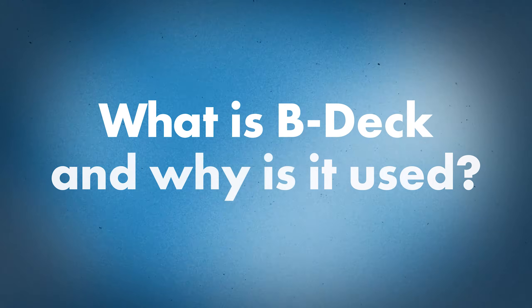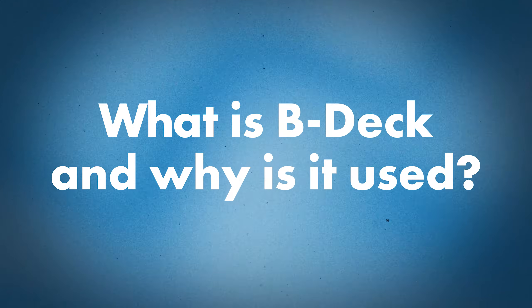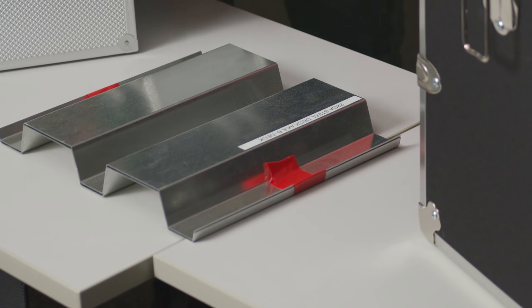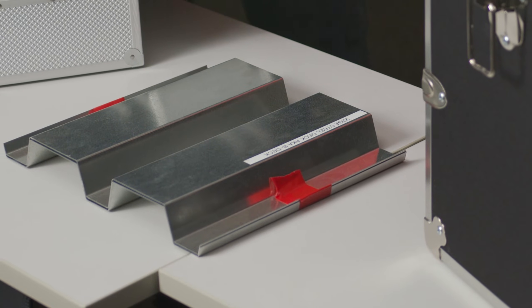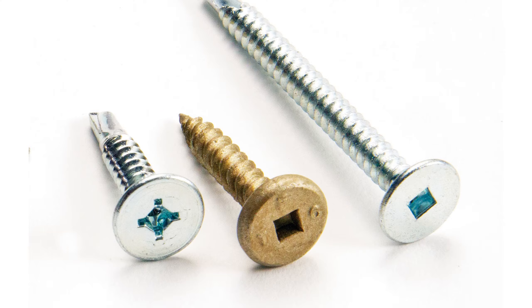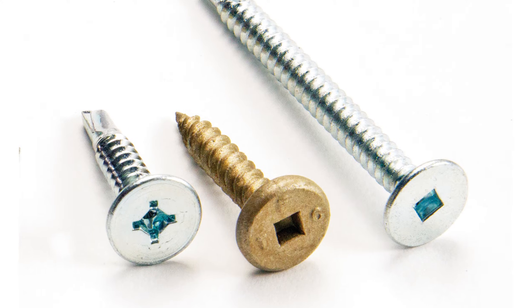So what about on the metal decking side? Let's talk about that. Tell me a little bit about B-deck and what that means for a roofing system. So B-deck is a corrugated metal decking. It's a structural decking typically on commercial projects, and it's 22-gauge or thicker. You have to use a different type of fastener in lieu of a sharp point like you would use into plywood. Now you have to use a self-driller, something that's going to bite through that metal.